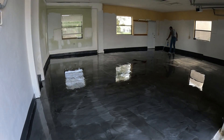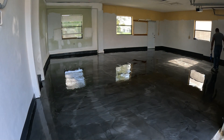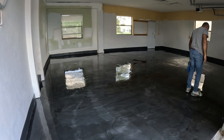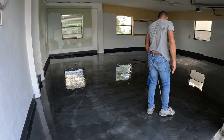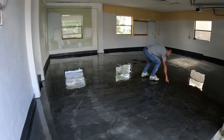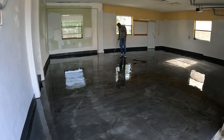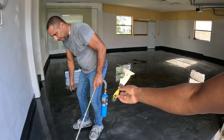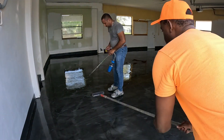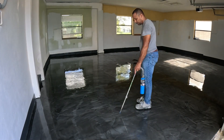Once the colors are mixed, it just looks like roller marks — still not desirable. But then the installer takes a propane torch and that's what disperses the pattern. This is where the artistry comes in: the heat blends the silver metallic and charcoal tones together, dispersing the colors and breaking up all the roller marks. You can see a lot of heat coming off the floor — a little scary at times — but the marble pattern really starts to show. He kept two garage doors closed to minimize dust, picking out particles and re-torching as needed.